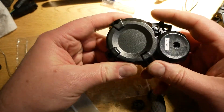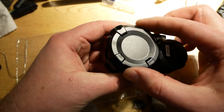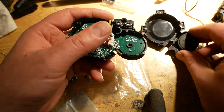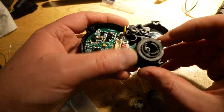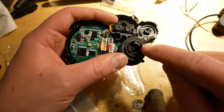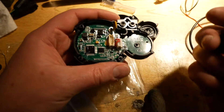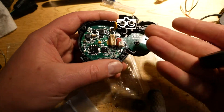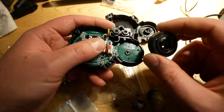On the underside you have three screws here and one here that you take out and then this back cover comes right off. Inside here there is a single screw that goes into that hole right there and this retains the board. It hooks over here and otherwise it's trapped underneath this disc which is the mechanical part of the hook throttle.